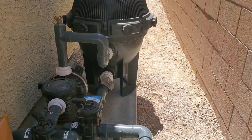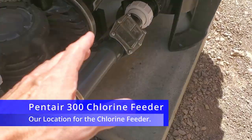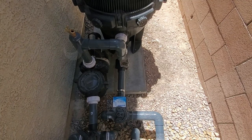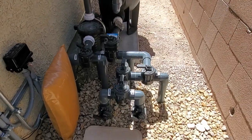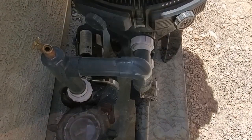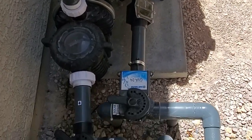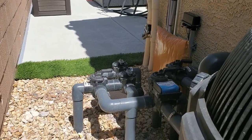For our current situation, the Pentair 300 will go right here on that pad. We could secure the chlorine feeder to this concrete slab, but we decided not to — it may crack the slab. These concrete slabs are not solid concrete; inside the slab is styrofoam, so it's too risky to mount the feeder to it. But it's okay — this feeder is not going to go anywhere. Once it fills with water and chlorine tablets it's pretty heavy. This install is pretty simple: only two hoses.